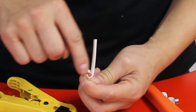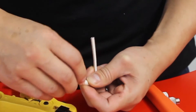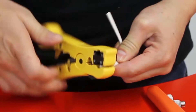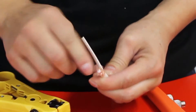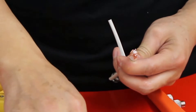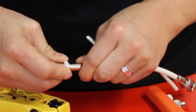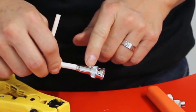With the cable exposed, push it backwards so it looks like this. Then using the wire stripper, cut the middle cable to expose the center conductor. If the piece comes out of place, just push it back. Now get the second piece of the crimp-on, press it in, push the back one forward, and you have a perfectly terminated crimp-on connector with no wires exposed.